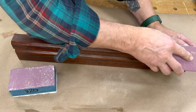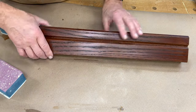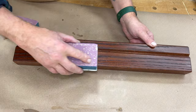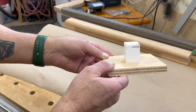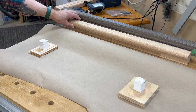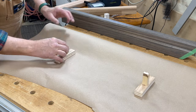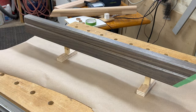This will show you what 120 sandpaper will do to your edges - you can see that instantly. What you want to do is get about three coats onto your railing components, then lightly sand with 320 grit after about the third coat, just to take the nibs off before your final coat. Sometimes the final coat will have a hardener to it. Here's a little tip: using the cut ends of an inch-and-a-quarter baluster attached to a chunk of plywood, you can use that as a platform to set a contoured railing on so you can do your staining and varnishing while it's sitting secure and not touching the table. I've also made them with a tapered wedge of half-inch diameter for groove railings that take a half-inch baluster - same concept.